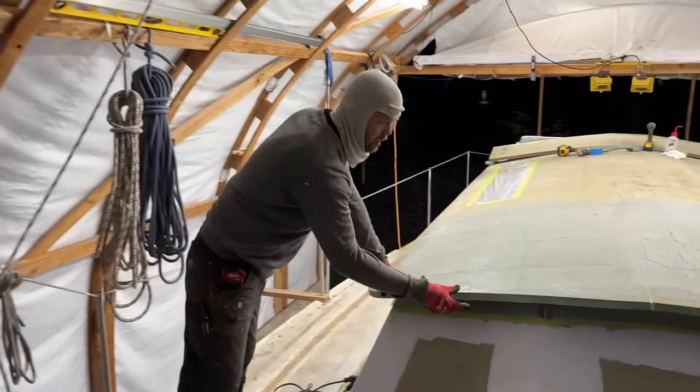I had my mom round off all the edges with the router in a 1/4 inch radius roundover bit. Fiberglass will lay over a round edge a lot easier than a sharp one. If the fiberglass can't bend around the corner, it creates a void under the fiberglass.